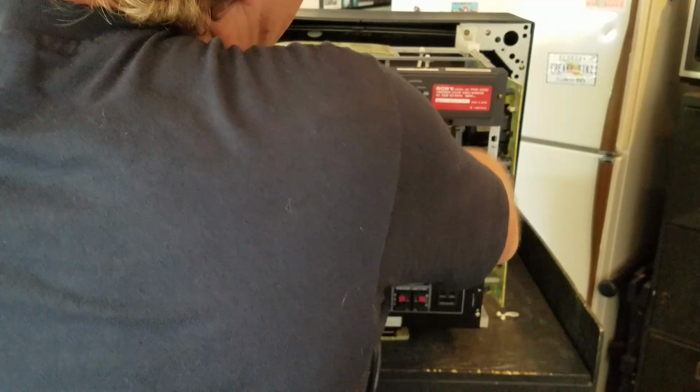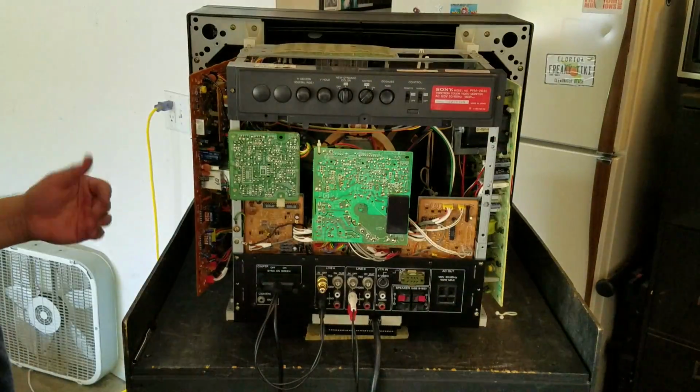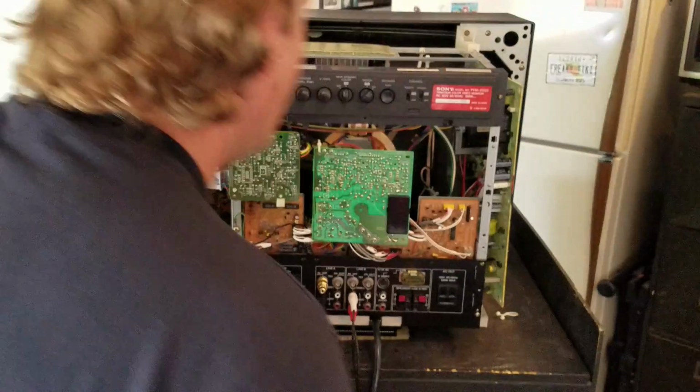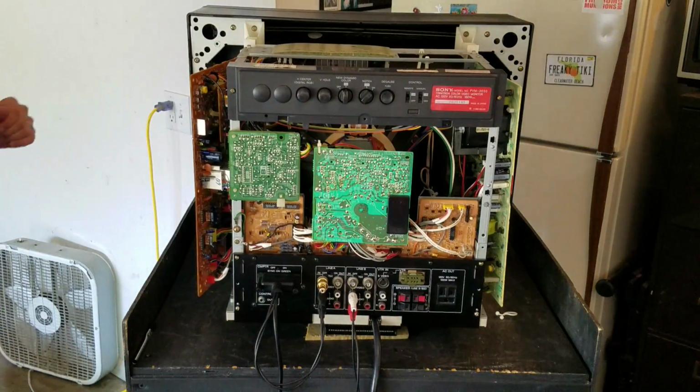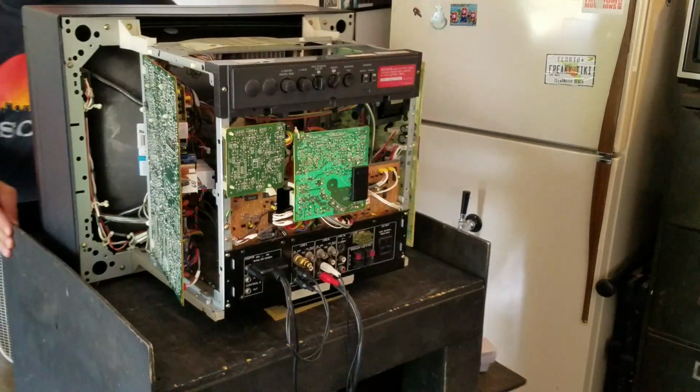Again, no worries. And just bracing my thumbs and touching just the white plastic that goes right up against the CRT back, I'm just going to turn that just slightly. You'll hear a little bit of that plastic turning, but just want to move it a little bit. And that's it. And then I'm going to go back, plug it back in. It'll automatically turn on. And let's see how our adjustment worked out. And that's just kind of the way we're going to work.